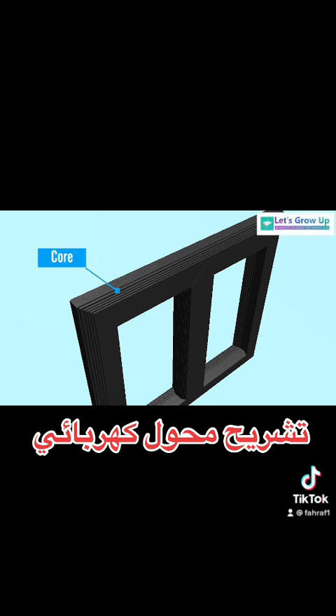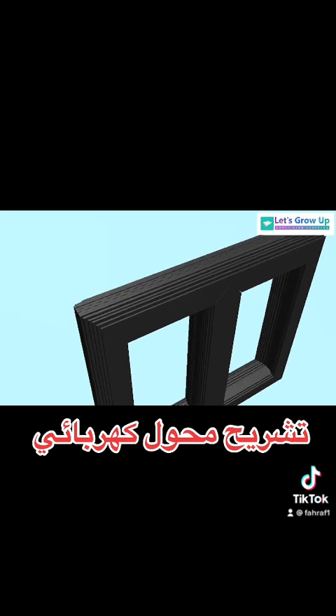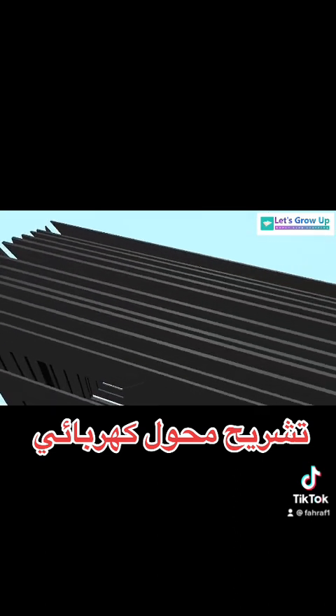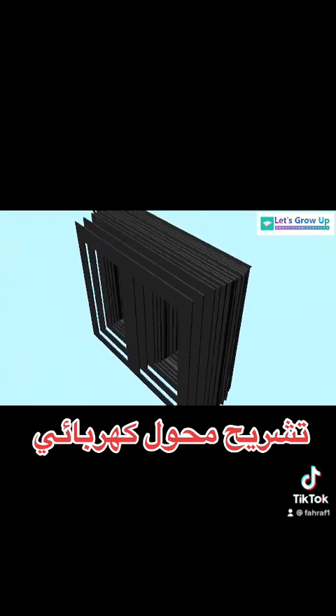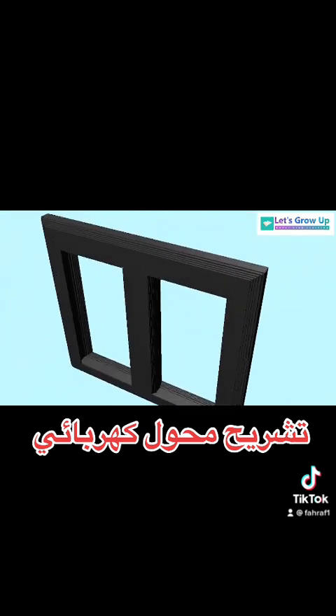The core is made up of soft iron or silicon steel materials. The iron core is made of thin metal strips insulated from each other by insulating varnish coating. The thickness of the transformer core laminations is usually in the order of 0.25 millimeters to 0.5 millimeters.